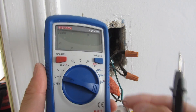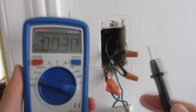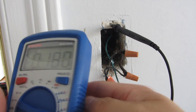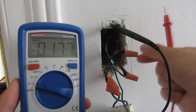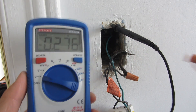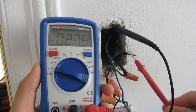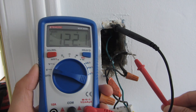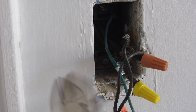I'm going to turn the multimeter to AC — that's the squiggly line. I take the ground wire and stick it into any metal piece, then carefully touch the terminal of this particular wire. This reads 122 volts, so I know right away this is the hot wire.